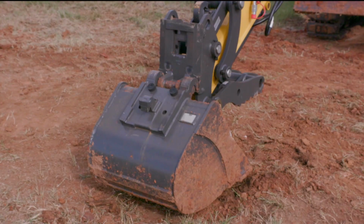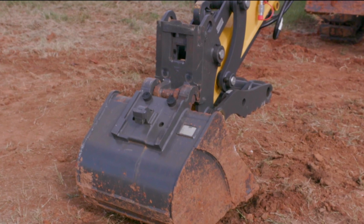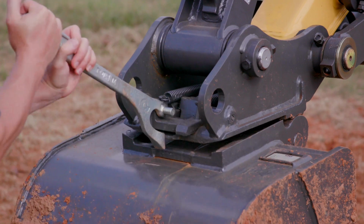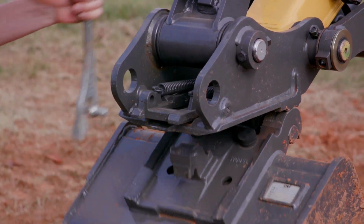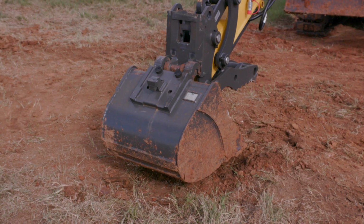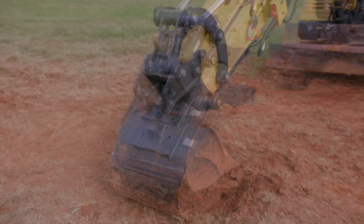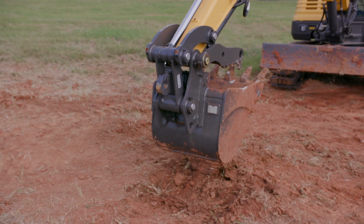The plate-style design of the Klac coupler makes disengagement and engagement of the attachment both safe and easy. After inserting the Klac tool into the eyelet, pull down to free the bucket from the spring lock mechanism. Picking up the attachment is as easy as catching the hooks of the Klac plate on the bucket with the coupler's pins and then clacking the attachment into its locked position.